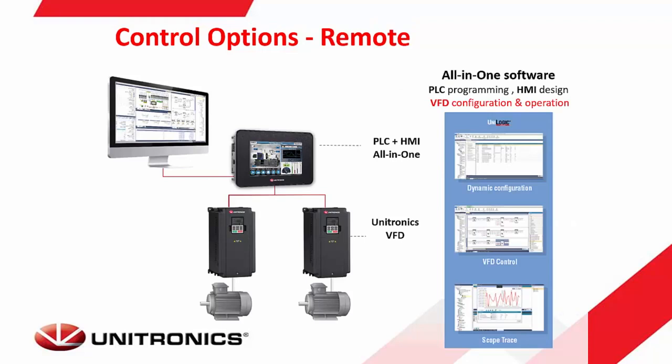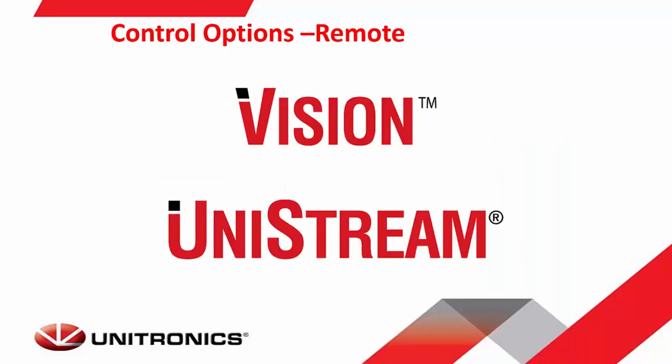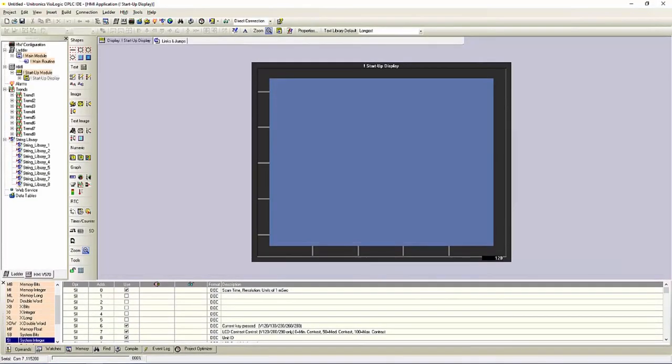The third option is going to be our remote control. And this would use software such as VisiLogic or UniLogic connected to one of our PLCs. Your PLC would then have a one-to-many connection to your VFDs using a Modbus RS-485 network. Today we're going to talk about our two lines, the Vision and the Unistream. So in our VisiLogic programming environment, right here we have a blank project. Let's go ahead and open up our hardware configuration.